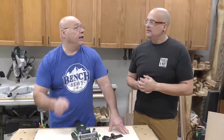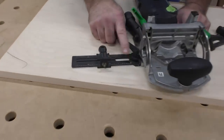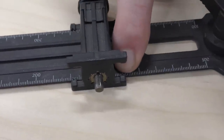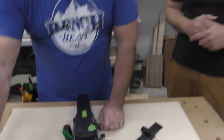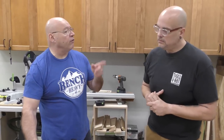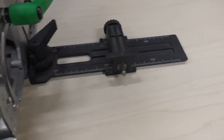What is one inch in metric? Approximately 25 millimeters. This is where the scale comes into play. You'll see the increments and you'll see this cursor and this cursor — it's always read by the inside cursor. I have it set at 150mm. How many times does 25 go into 150? Six — so that's approximately six inches from center. I can space my Dominoes out when I shoulder that pin in the mortise. You can space them anywhere from 100mm (about four inches) to a little over eight inches apart. We're going to sit at 150 millimeters — it's easy to remember — and I set the one on the left and the one on the right each at 150.